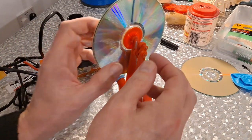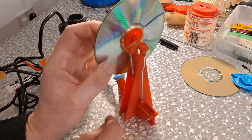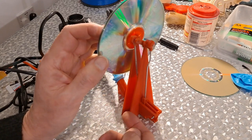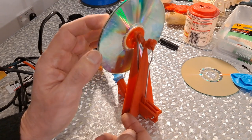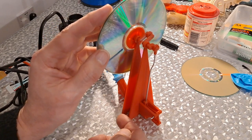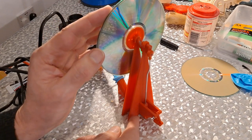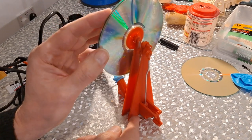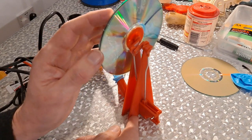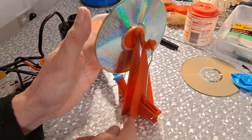To adjust the timing, I'm just turning that arm in relation to that arm. So what we need is just a short burst of air. When the valve is in, the air is cut off. So it's off at the moment, off, off, off, probably still off now. We don't want air coming in now, but we're actually getting air coming in now. And now we're cutting it off again, so that's not quite the right position because it's the opposite way round if I spin it in the opposite direction.